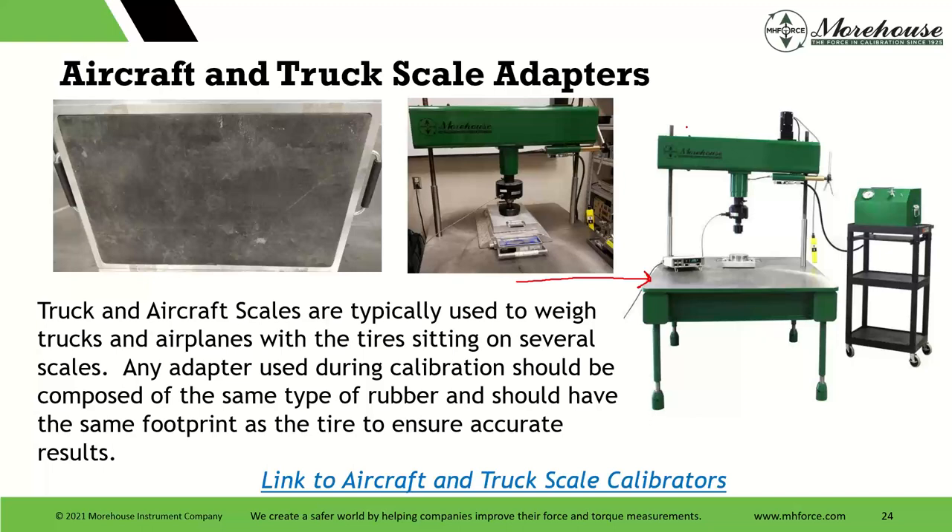I was sitting with somebody evaluating truck scales, and they told me this manufacturer had ridiculously good performance. He worked at NIST and wanted to see the data. When they gave him the data, he looked at it — two of the readings were out. They were basing all of their specifications on the average of all three: a low, a middle, and a high that averaged to a nice value close to nominal. The joke became: it's going to be difficult at a truck stop to have a semi turn around and do three repeat weighings to get an average in actual use.